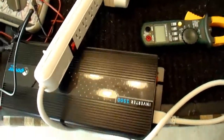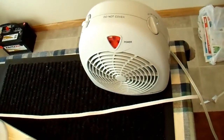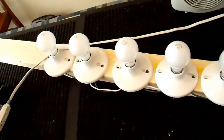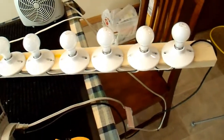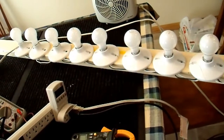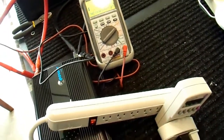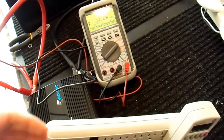For the load, in the past I've used electric heaters and that always gets really annoying. So I do have an electric heater here that I'm going to use for some of the load. But I finally made myself an adjustable load out of just a bunch of lamp sockets, and I put in 100 watt light bulbs, which I hoarded when they got banned — so I have plenty of those available. This is nine lights, just mounted to a 2x4. It took me an hour or two to make this setup but it'll make things a lot more convenient. I'm going to set up the camera on these three meters all at the same time, screw in the light bulbs one at a time, then go back, look at this video footage, and make a chart on my computer.